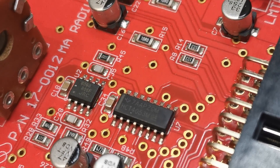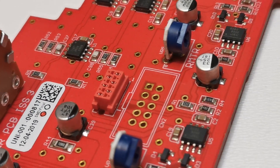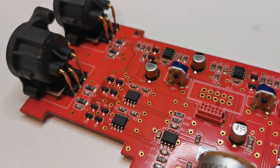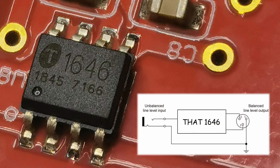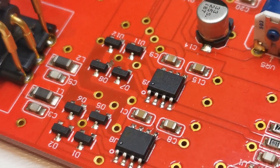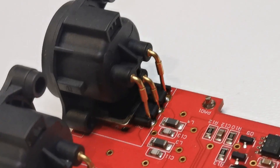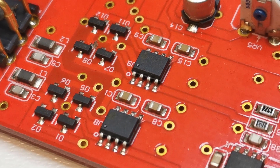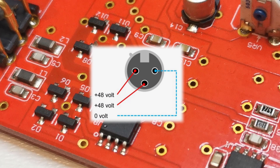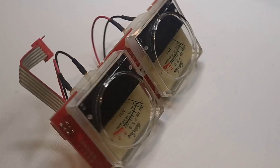The headphone section also has switching logic that allows operation in split-cue mode. Here we can see the meter driver circuit with trim pots for calibration. And finally we've come to the end of the Radius 4 signal path. The master output uses the same balanced line drivers as the booth and AUX outputs. The output chips, which are quite expensive, are protected from external damage with transistors working as diodes — useful when someone plugs the mixer into an XLR input with +48V phantom power. Last thing before measurements: the VU meters — nothing to comment, just watch how they look.